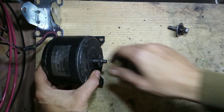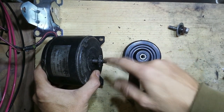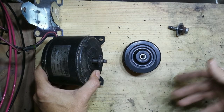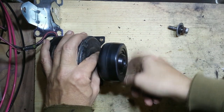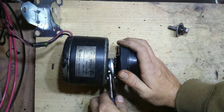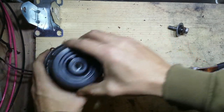I have a 24-volt 250-watt DC electric motor — it came off an old Razor scooter or something like that. These are great to use; the shaft size matches directly to the coupler. You just have to make sure when hunting for extra parts like this that some come with a reverse thread and some with a standard thread. Get the ones with standard thread, because you're never going to find reverse-thread bolts for it. I'm just going to screw this onto the end of the motor and tighten it really well with shaft pliers so it doesn't slip off while you're riding.